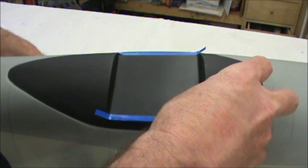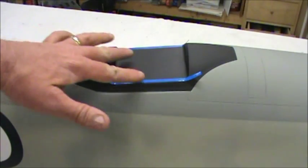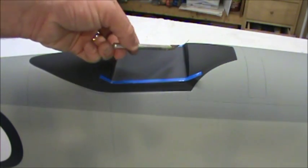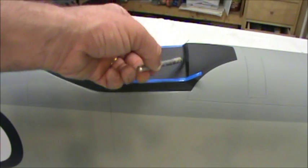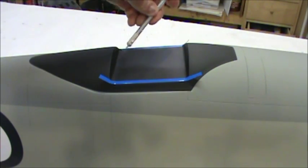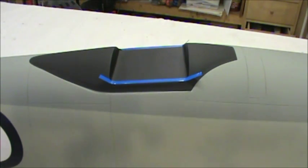In the end I may end up making this less than a quarter inch wide, but it's easier to take off more than try to add it back. So I'm going to go ahead and get this cut out. I'm going to cut it all the way across flush where it's 90 degrees, then cut it back across here so we're leaving this part of the bulkhead on both sides. I'm going to cut that square out to begin with and then we'll move along.